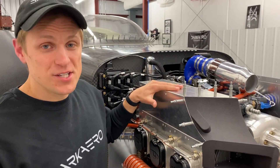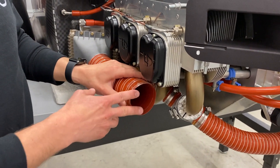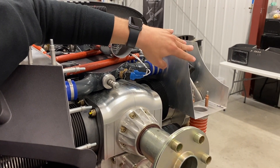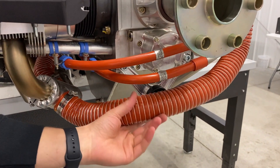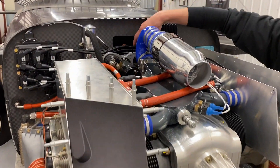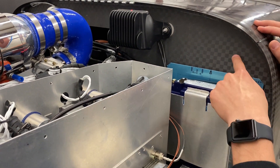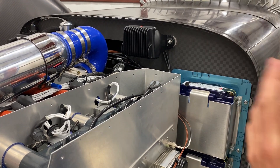So what do we have left to fully finish up the engine installation? A few miscellaneous clips to constrain wires and ducts. The intake for the oil cooler has to be completed — that's 3D printed. We're going to install the throttle cable to control the throttle on the engine. We also need to install the intake for the engine and the intake for the other cylinder cooling plenum. All these intakes are 3D printed with a little lead time, hopefully arriving in the next week or so. We'll also constrain the ignition wires and CHT wires, finish up the battery cooling box, and install a master relay and a couple of fuses. Once all that's done, we can install the titanium heat shield and insulation on the firewall and we'll be ready to rock.